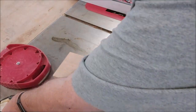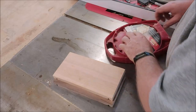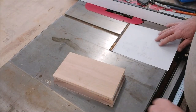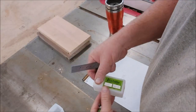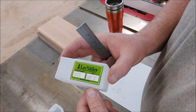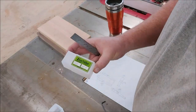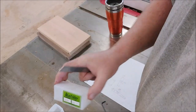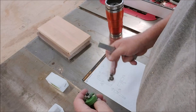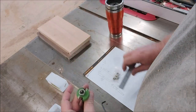This one's a little bit warped, but I can pull that in with the clamp, I hope. It's a little bit harder on the walnut — it's darker. You can buy white pencils when you work on dark woods; really helpful. Okay, so now we have to do the most complex part. I'm going to get my router set up. This is my Lee Valley rabbet set — and if you're woodworking, invest in good router bits. They're not cheap, but they're very flexible.